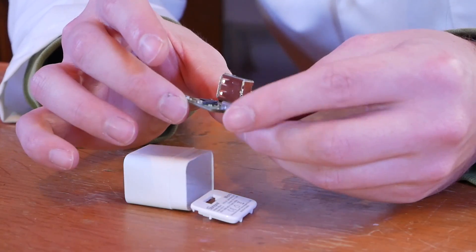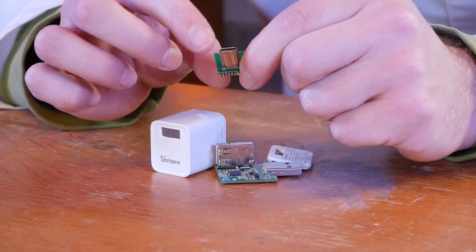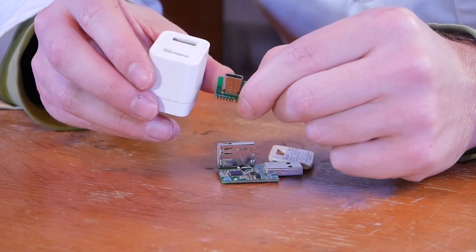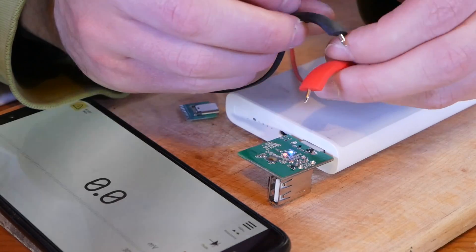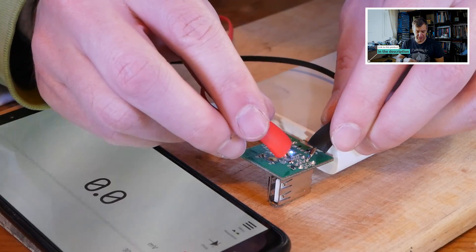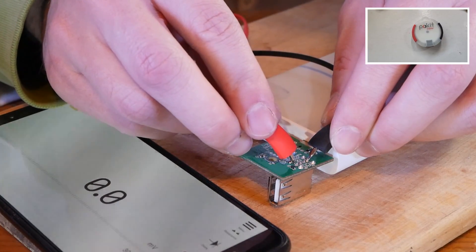So I thought I'm going to do something else. There was one way I could improve this — by adding a USB Type-C port. While I'm aware that it probably wouldn't be fully-fledged USB Type-C with all the bells and whistles, it still makes it a fun project. Now first, I had to test the pinout so I would know how to connect the cables, and which are the power pins on the PCB and which are the data pins.